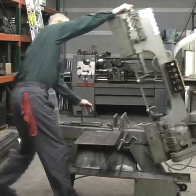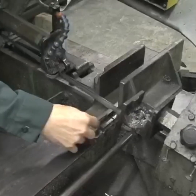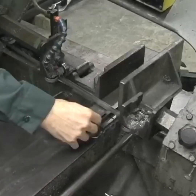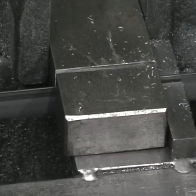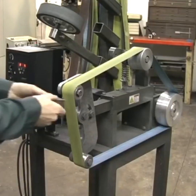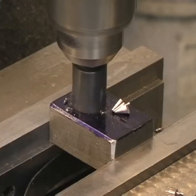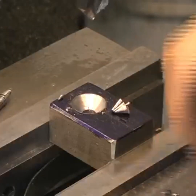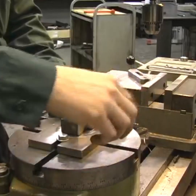These parts turned out really nice. The next part is the knuckle, and I'm going to make it out of some scrap material found in the shop. At the bandsaw I cut off a little block of material, then go to the belt sander to deburr it and knock off any sharp edges. Back in the Bridgeport, I'm just going to drill and countersink a hole to mount the workpiece back on the rotary table like we did earlier.